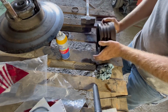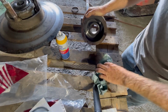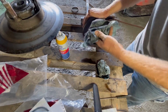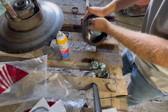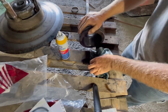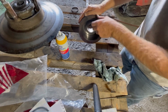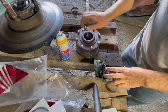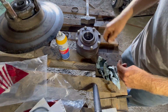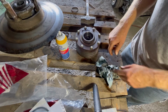So that's got that O-ring. Let's take a quick look over here, make sure we're all good to go. Just take an old rag and reach in there and wipe any crud out. Just like that. And one thing to do when you go to put these things back on, especially back on the combine, take a little oil and oil that O-ring up. That way it's not trying to jam onto that drive line, and it's a good way to take a nick and tear that O-ring up.